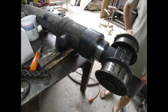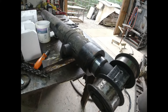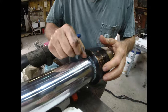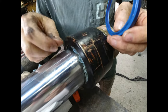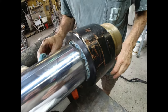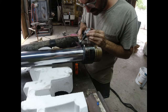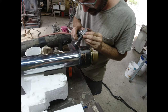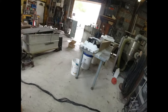For the life of me I could not get the wiper to go over the end of the shaft and got real frustrated, so I put it together without the wiper. But it really needs it. So we're going to try something different - I shoved a paper towel in there to keep the seal protected, then we're going to take the grinder and round over that little lip, and cross our fingers that will allow the wiper to pop over the bump. This is as far back as we can pull the cap because the oil seal is holding us from going further. We stuffed it full of paper towels to protect the seal from metal dust, ground it and rounded it - and it worked. We got the wiper to pop in.